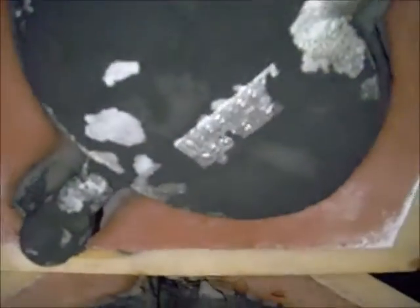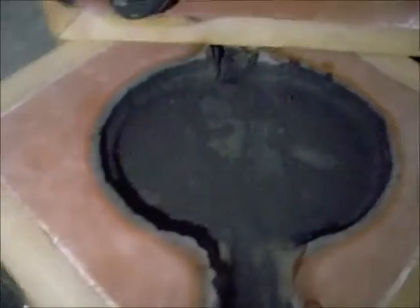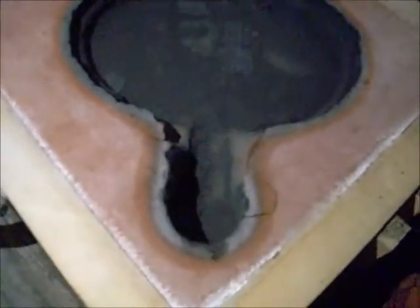You can see, if the light in there is close, the little initials, or little letters I put on there, actually did show up. So now we got to scrape away the black sand, because that's actually oils burnt up on it. And then all the rest of the sand can go back in and be reused. The black sand has to be mulled before we can reuse it. And hopefully I'll be making a muller next.